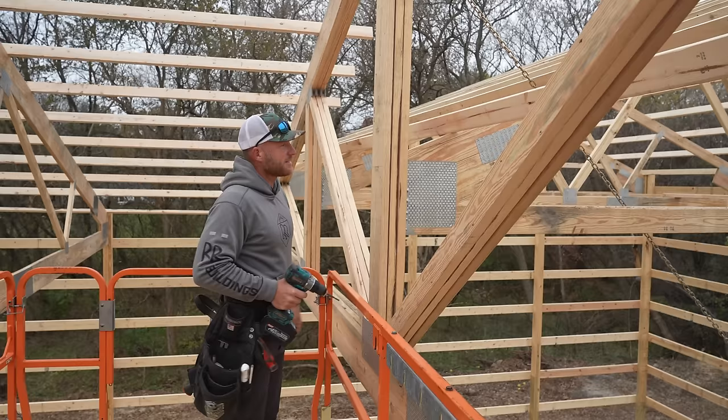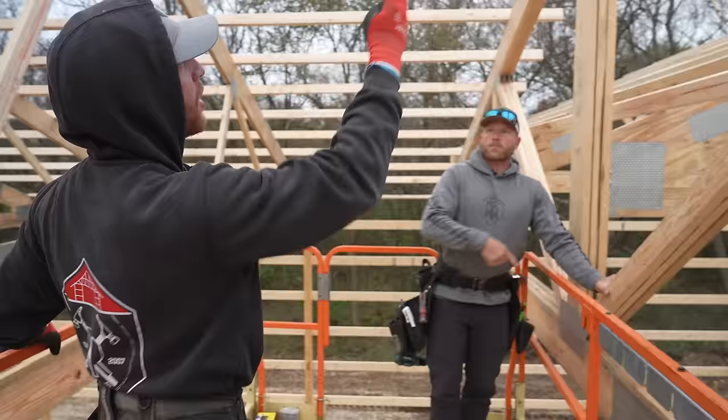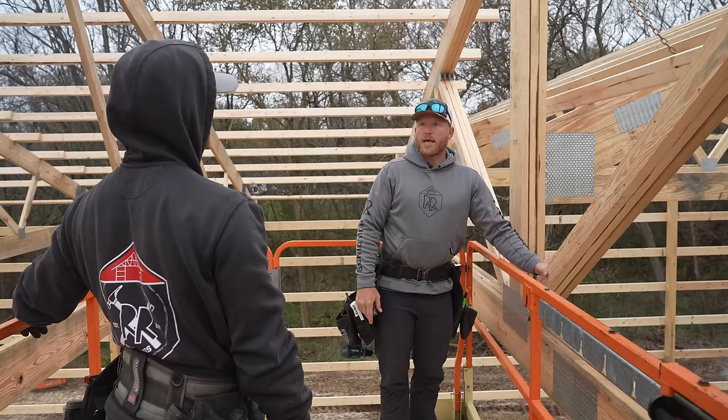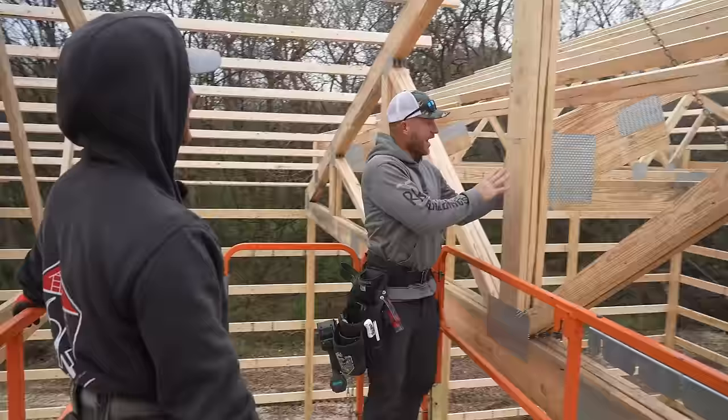I guess I don't even know if I should say length or width. Honestly, that doesn't matter. Well, sure it does, if this is locked in. But we're going off the outside of the truss. But if we do a bottom chord, if we put a wind tie in here, go off the bottom outside. Yes, that is true. And then those other plies just kind of get, but then you're potentially not in plane exactly. So by making it all perfect, it will be better than spread out. If this is tight... No, I agree. I think everything should be tight. But for dimension-wise, I don't know if it's that important.